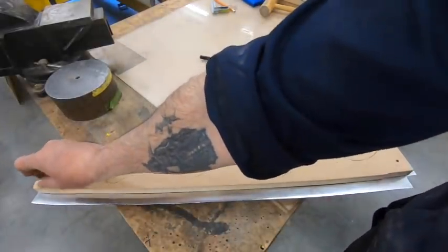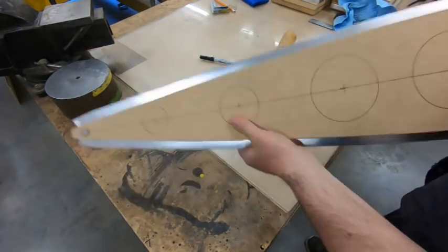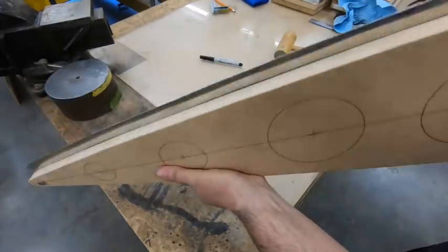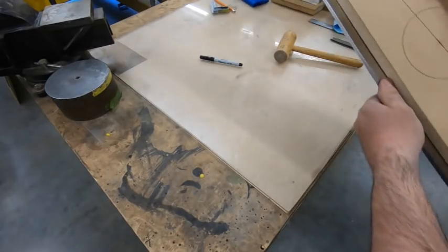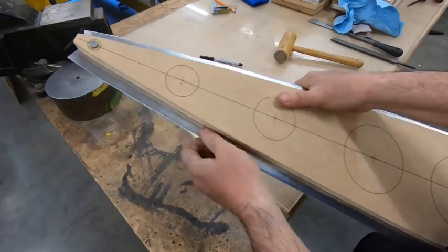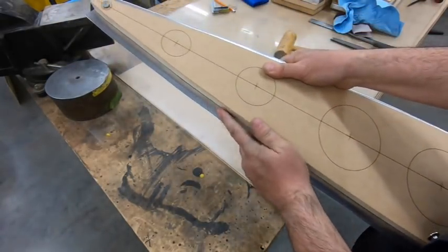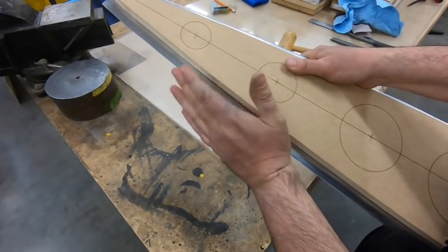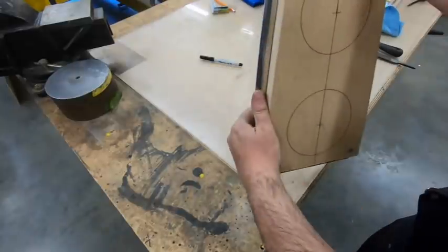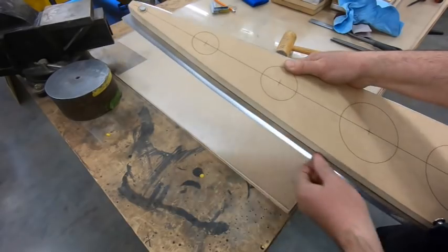We take our bolts and assemble the form block. That's the sandwich that we need, and I can go in here now and bend all these flanges over. It's kind of important to note that the flange does have a curve to it — it's very subtle. So there's not going to be a lot of shape change here, but this is going to be a shrink flange because it's a little bit of a convex shape. There'll be a little bit of material that will have to either shrink or maybe catch in a pucker while I'm doing this.